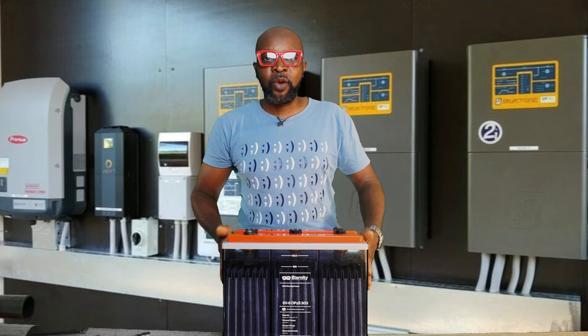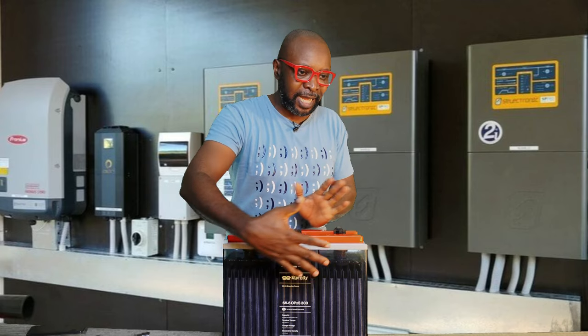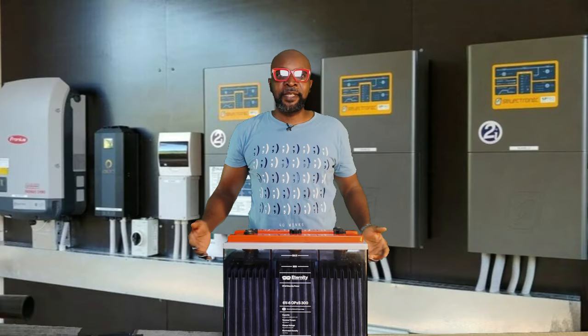Number nine: make sure the batteries are well spaced out. When stacking multiple batteries — four, eight, or more — never pack them tight together. Batteries expand during charging, so they need room to breathe.